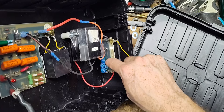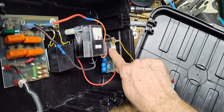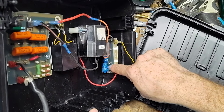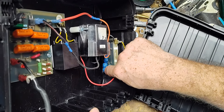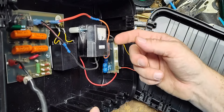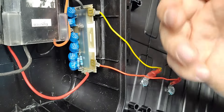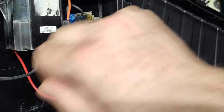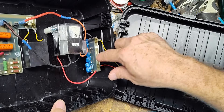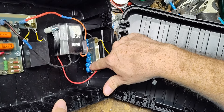This output board from the original unit was bad. The resistor looked good, but once we got the thing running again the light would barely flash. I tested that resistor and it was open - very, very bad. So we needed a 68,000-ohm resistor, about a 2 or 3-watt. I didn't have one, so I took two 100K-ohm resistors and wired them in parallel, which makes 50,000 ohms. That's better than 100K because it allows energy to come into the bulb and let it flash. These are 1-watt resistors; I soldered them together in parallel and wired them in.